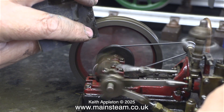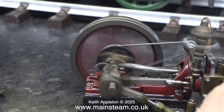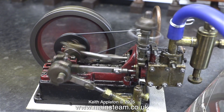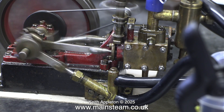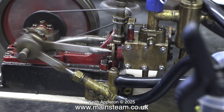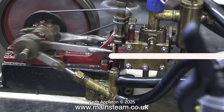As you can clearly see, I'm using a piece of wet-to-dry sandpaper, and I'm using it wet — but not with water, I'm using WD-40. Once I wipe off the residue, the flywheel now looks quite good. This old 10H is fitted with a crankshaft-driven water pump that feeds water into the boiler. It will need a bypass valve fitting — more about that when I build the steam plant.